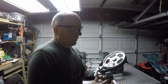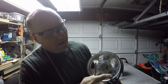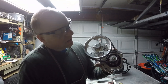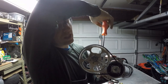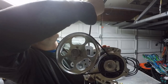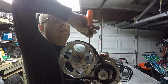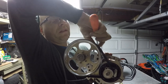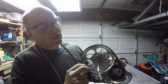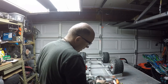On this particular drive unit, belt tension is handled by a screw that pushes on a finger, which swings the motor outward. As I turn the screw, the belt tightens up. As I spin the screw out, I can swing the motor inward and loosen the belt to remove it or adjust tension. That's how this drive unit's belt tension works.